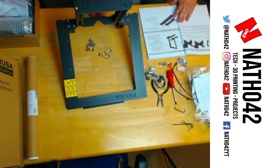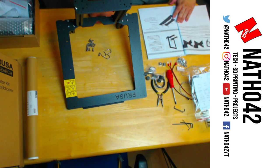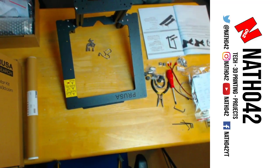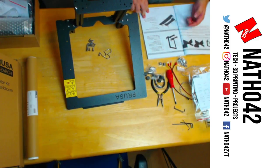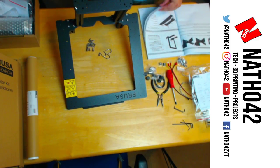Alright, let's see what it's... I should probably read it, to be fair. Take the shorter, blah blah blah, screw them bottom diagonal. Again, make sure, before we proceed further, let's make a last final check. It's important to have the extrusions on the correct side of the frame. Important, long extrusions must be on the side of the frame with the Prusa logo. Yep. Also, ensure longer extrusions are closer together. Yep. Short extrusions must be on the side of the frame without the Prusa logo. Also ensure shorter extrusions are further away from each other. Okay, I've done that. That has been checked.